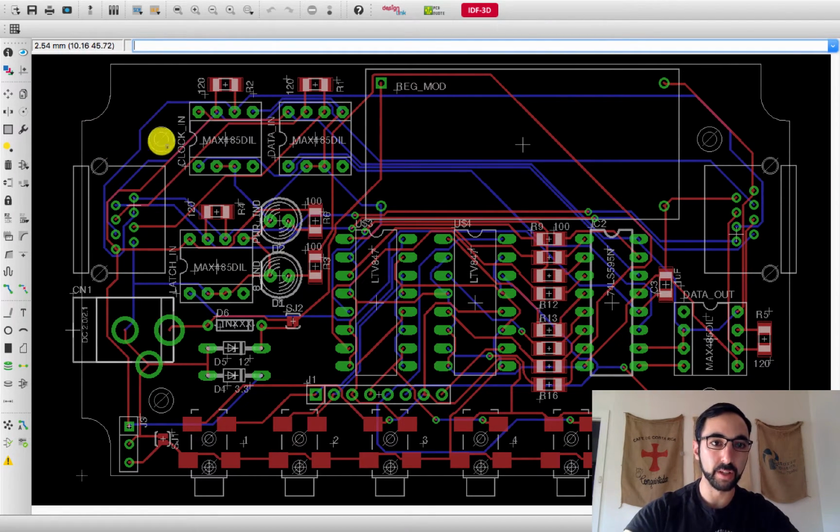So you can see, you know, clearances around the holes, clearances from the edge, the curve there, and the jacks are slightly popping out so that, you know, they're beyond or butting up against the outside edge. And that's basically how you do it.